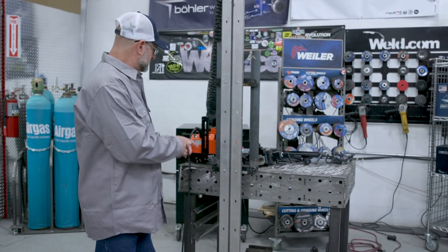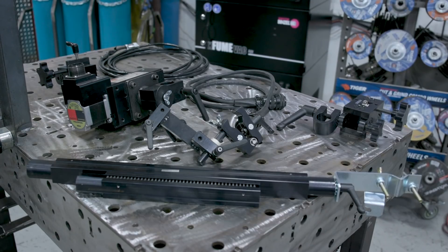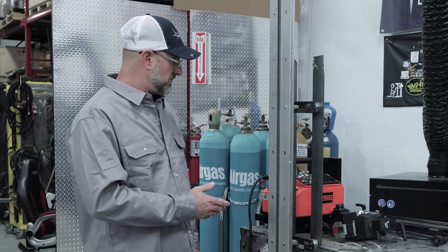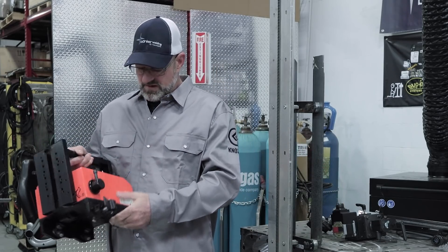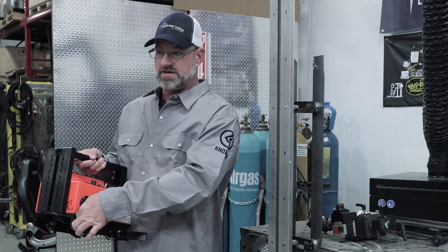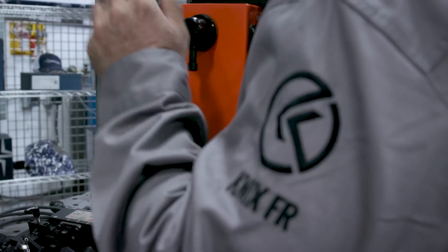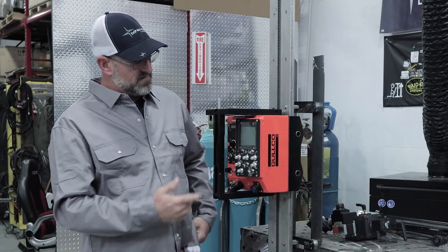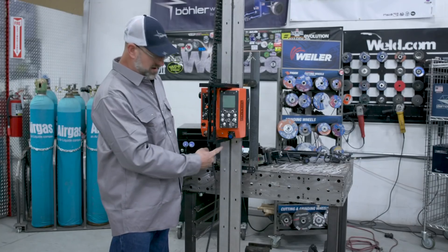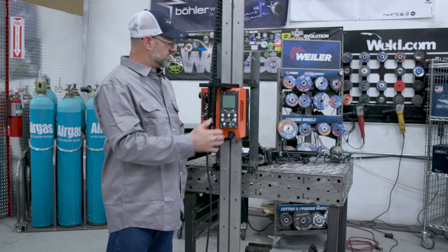What I'm going to show you today is the GKR 300D CAT series carriage — how to install it on the track and how to put the components and accessories on it so we can get started welding. I'm going to put the carriage on the track. It only weighs about 17 pounds — very light, easy to maneuver. It's got the paddle lock design with your clutch assembly to keep the gear engaged, and the wheels just fit right on the track. It has a dovetail design handle where you put your accessories on the top, middle, or bottom.